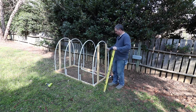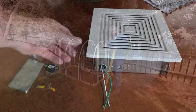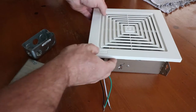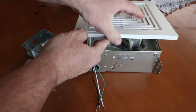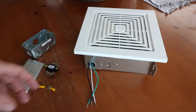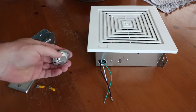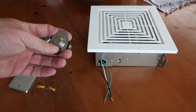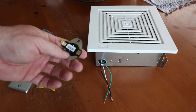So those are the four uprights in. Now I need to put a piece across here and mount the fan to the bottom of that. Here are the pieces I'm going to use for the exhaust fan in the little hoop house — this is just a basic bathroom fan. I'm going to mount it on the end walls after I build them. It's got basic three wires coming out of it. My solution for an exhaust fan in a small greenhouse is this thermal switch.